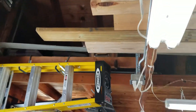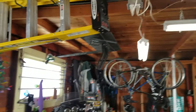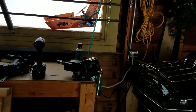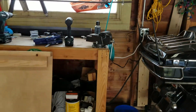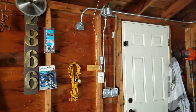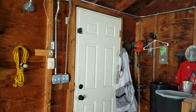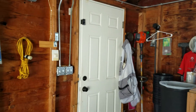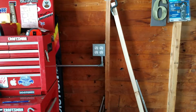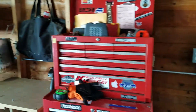Just wanted to do that little hack. There's some more of my wiring that I'm still happy about. I did put a new breaker into the garage, so now when I have my air compressor going, it doesn't blow the breaker. Because when they originally wired this garage, all the garage electrical was hooked on the same circuit as the furnace — so if you had a tool running and the furnace kicked on, you tripped the breaker. So we had to fix that.